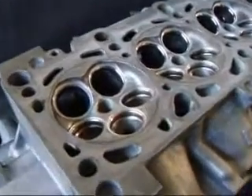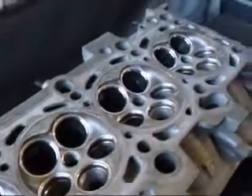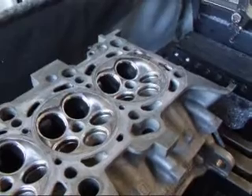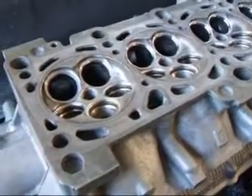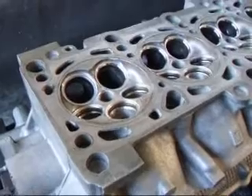It's a real nice little piece because it has five valves per cylinder, so it breathes quite well. One of the problems we find with these, though, is we have to change the timing belt at a regular interval because if we don't, we have a lot of bent valves, which is what happened on this one here. We're just going to resurface this to renew the surface so we have a good bite surface for the gasket. So let's get started.